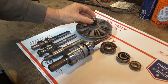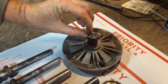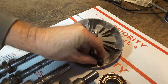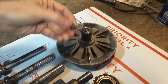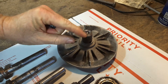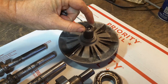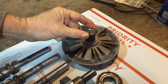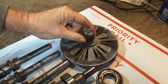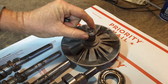The smallest bearing is the control shaft bearing. Here's one that seized and the person kept using it, ground it down to nothing. It should be sticking out like this — the button. This person ignored the sounds and ran it down to nothing. This is the smallest bearing in the machine. It can seize up without notice, without warning — tiny little balls inside the bearing, so they can go.